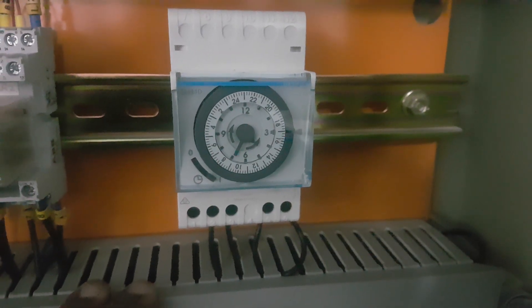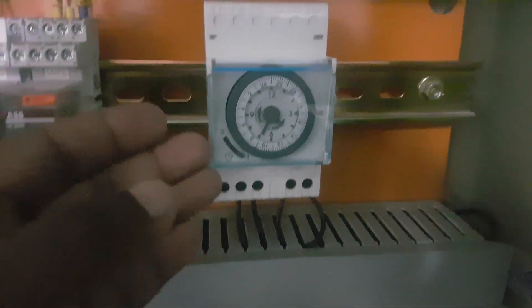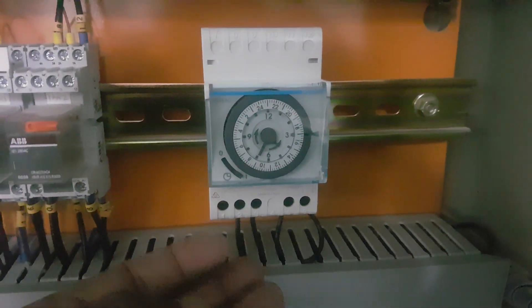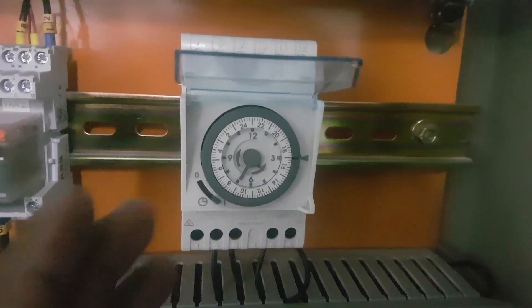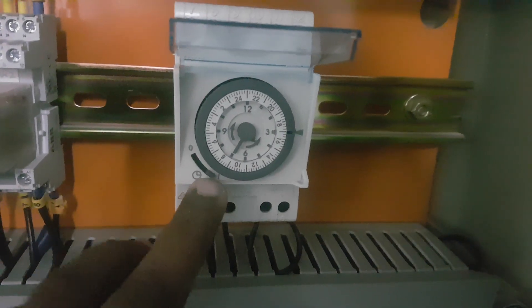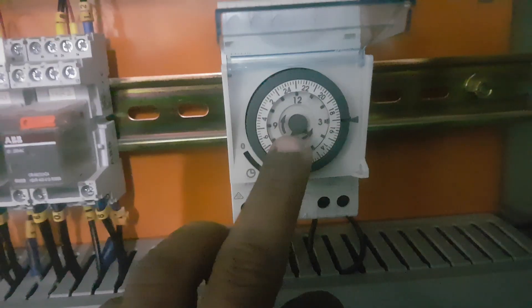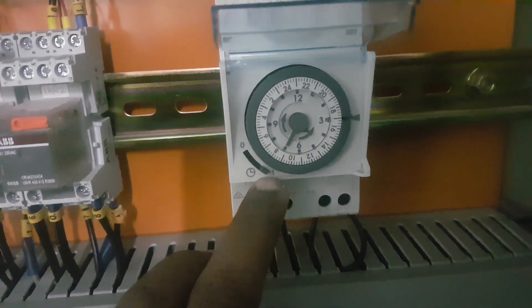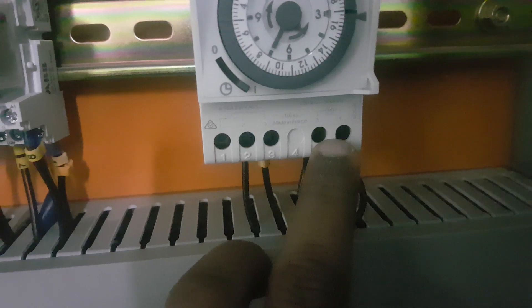I will explain the inside items and the connection wiring. We will open this one. You can check here — there are a lot of dials. The power supply module: terminals 5 and 6 are the 230V module where we provide the coil supply.